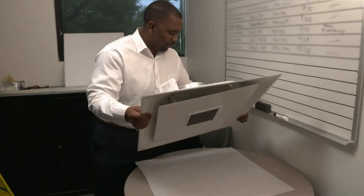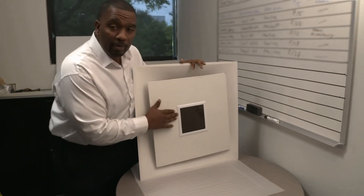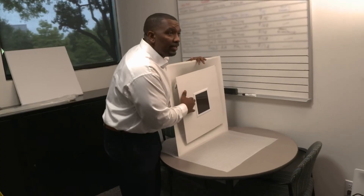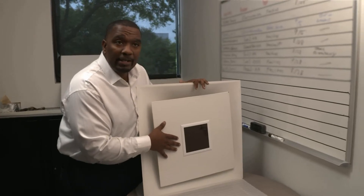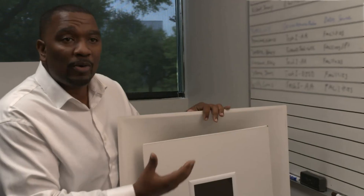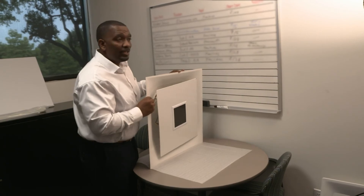The way the diffuser operates, it has a solar panel mounted on the face which captures ambient light in the space. The diffuser wakes up every 10 minutes to sense temperature in the room and will reduce or increase the amount of air being delivered to the occupants — that's how it controls temperature. It's no different from any other diffuser install, except it's just a smarter device.